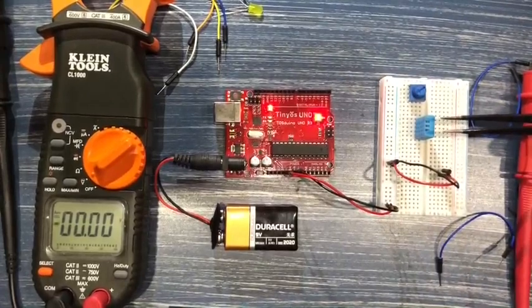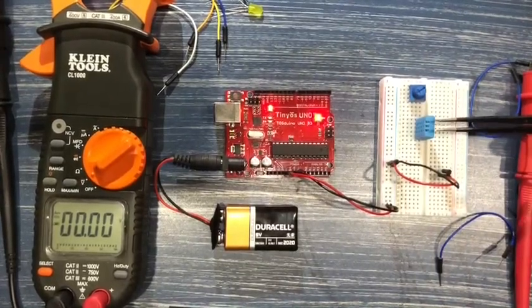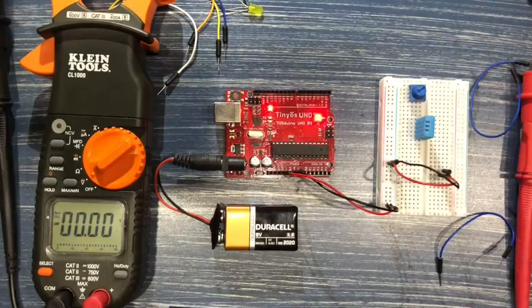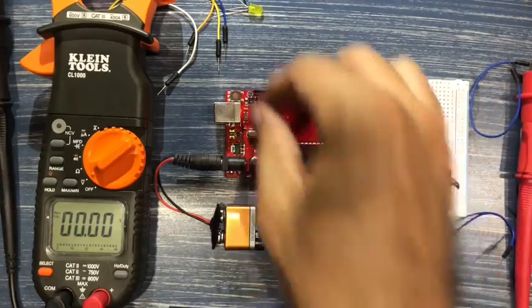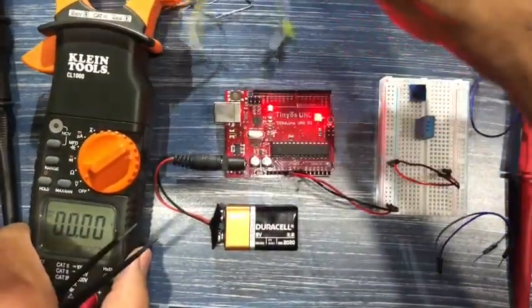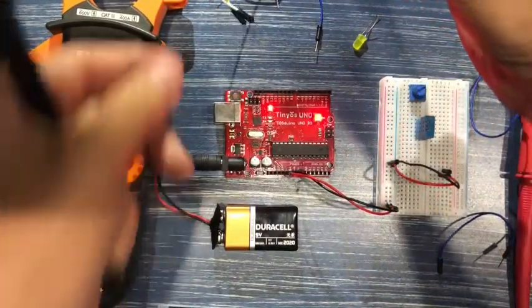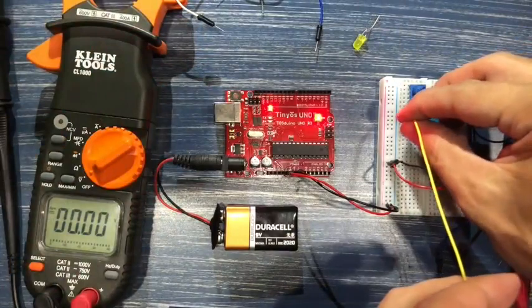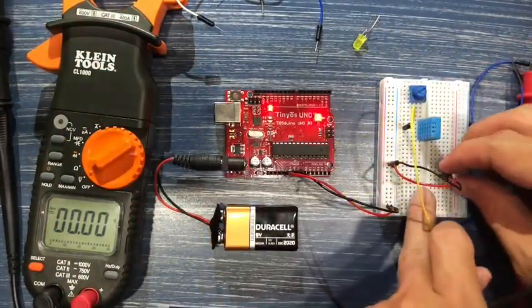And we're going to look at how that works, how we find out what a sensor needs to be connected to, and how to actually get it onto the computer. So we're going to switch over to the computer right now, and we're going to look at the pinout, which is how to find out what these 4 pins are on any component, not just on this one. And then we're going to actually connect one of the jumper cables. Use the yellow one. I like using yellow for signals, or blue. And we're going to use that third pin to get a signal out of it.